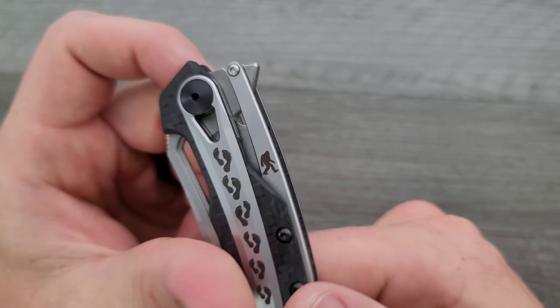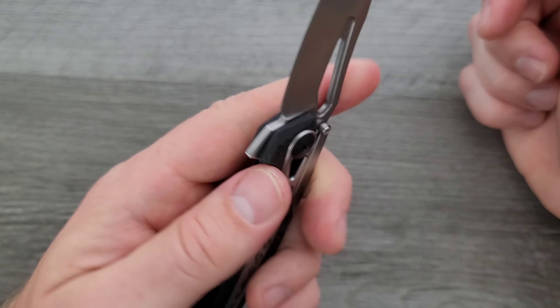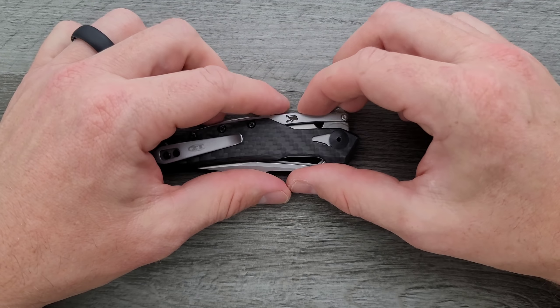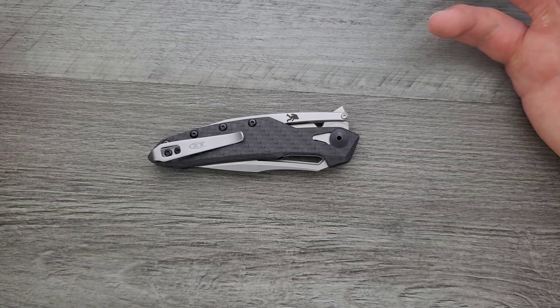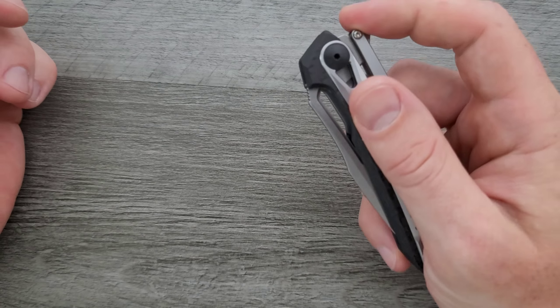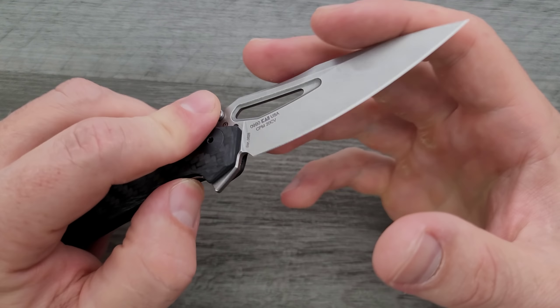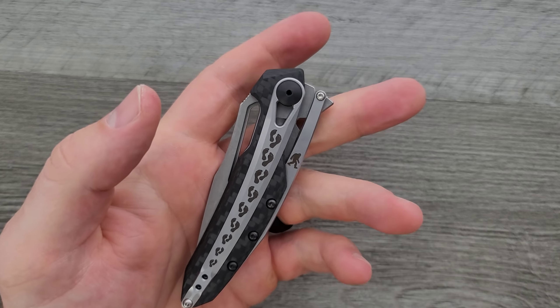This side right here is much the same as the front. There are holes near the pivot so that gunk can get in there. As far as exposure to the internal pivots — if it's running on bearings, it doesn't matter if this whole area is covered, dirt and debris is still going to get in there. So it's a little more exposed through these holes, but more of the problem area is the exposure of the detent ball hole and detent ball path. I just don't really care about the holes right here.